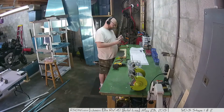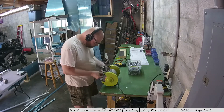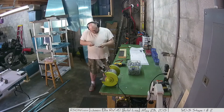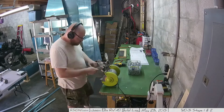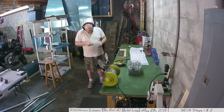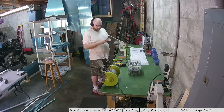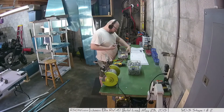Right here I'm working on the horizontal stabilizer attachment bars — you have to hammer them a little bit to make them flat. It does tell you to preload and give them a couple smacks to make sure they're flat, and you actually have to do this a couple times. These were ever so slightly bent. Next time we'll talk about creating all the fuselage stiffeners and basically putting the fuselage together — a hell of a lot of fun, and you actually start to get a good notion of what this thing is going to look like. Thanks for sticking around, I really appreciate it!